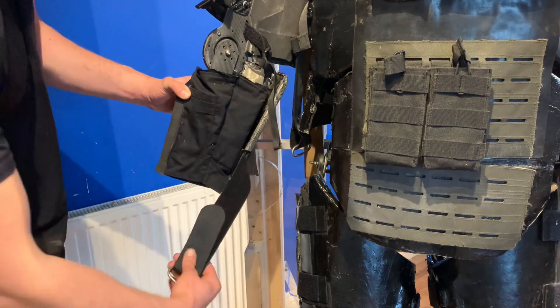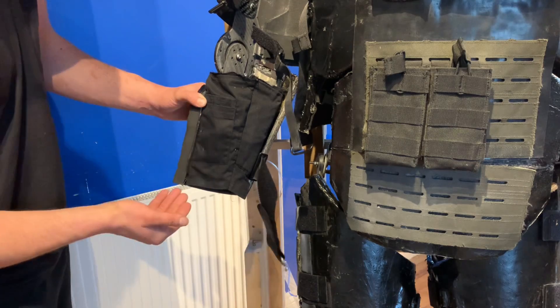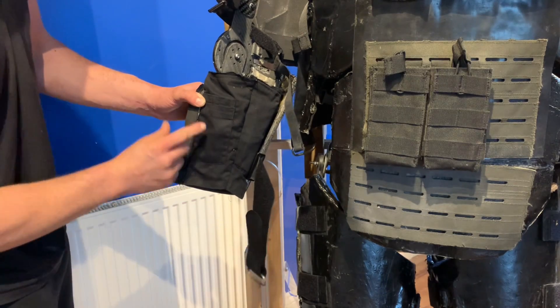In the future I'll probably get away without the large strap around the middle, as it just doesn't do that much — it has to allow for give in the bicep and tricep when you move your arm, so it can never be that tight. The top and bottom straps can generally be pretty tight while still being comfortable. Looking at the forearm, it does have straps that come around the side and actually has a sleeve sewn into the bracket tray, because your arm changes its dimensions quite a lot when you rotate it.